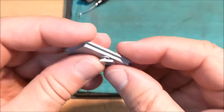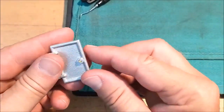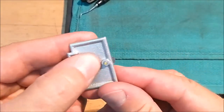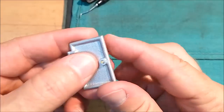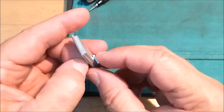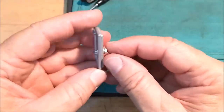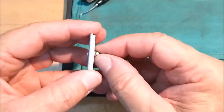Well, ultimately, this is what's going to happen to this little piece. We're going to put a cam on it so that when you close the door, it kicks out like that and locks the door. Looking at the space constraints here, there's not a whole lot of room in the back to work with, and I think the knob is a little bit thicker. Well, I know the knob is a little thicker, so I'm going to make the cam in one piece